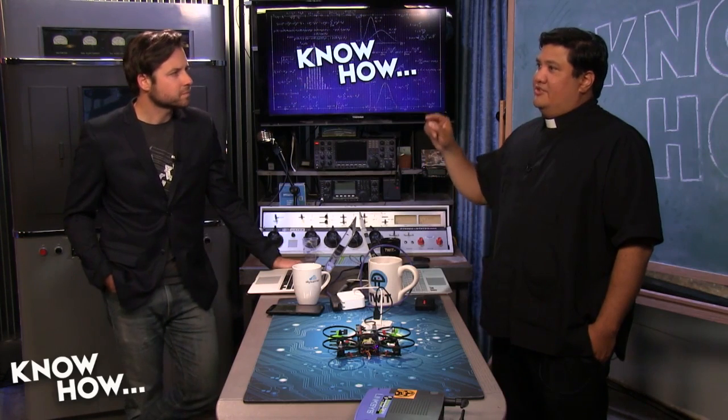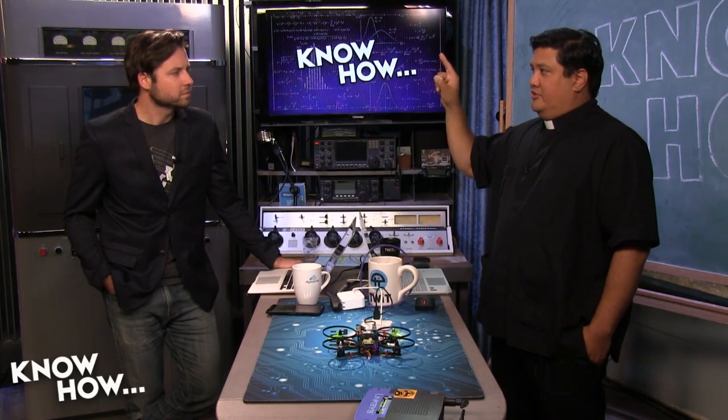What you can do is disable those devices. In both Clean Flight and Base Flight, you have the ability to turn off sensors. Turn it off and see if all the erroneous flight inputs go away. If it does, it's probably a bad part.